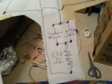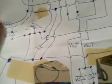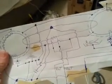And so the load is my voltage out. And then I got voltage in over here, but I have voltage in combined. Actually, there are two pairs of voltage ins, and they really should be separated. So that's why I have these connections here, these branches. Because you don't want the voltage in that supplies the ground, the earth ground, combined with the voltage in that feeds the toroids. It helped me understand the circuit better to combine them, but technically they really should be separated. So I really should have two power sources here, and I do. I have two battery packs. So that's what I should do.